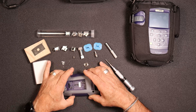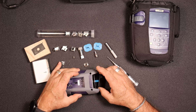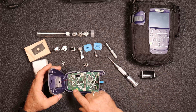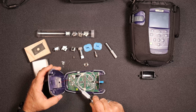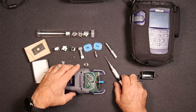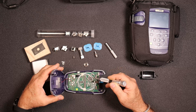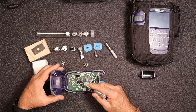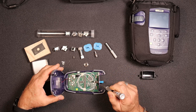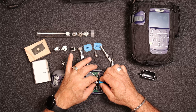So once this is done — we've already pulled the batteries — we're just going to go ahead and lift this off. Take your dust cover out. This has a battery cable that runs down right here — that is a quick connect. You can pop that off if you want, or just lay it aside. Here's the cautionary note as we start looking at the internals: this is a little coil of fiber on the laser. We have our two lasers, our 1310 and 1550, and they come up to an FC connector. We're not doing anything to the internals — we're merely going to remove this FC connector.